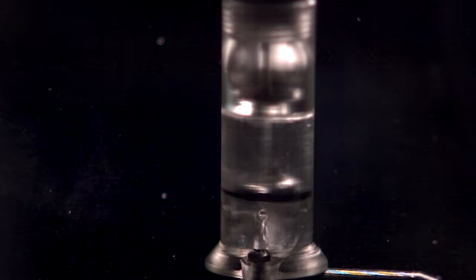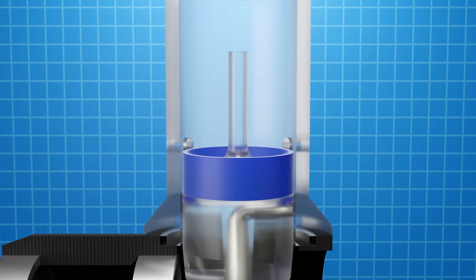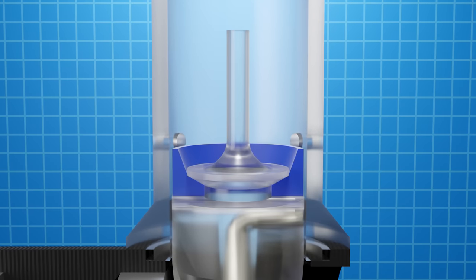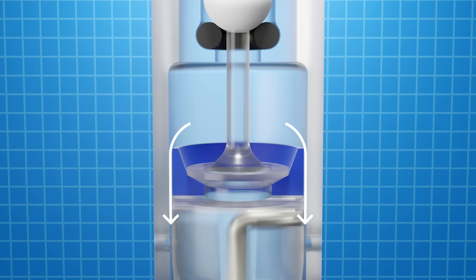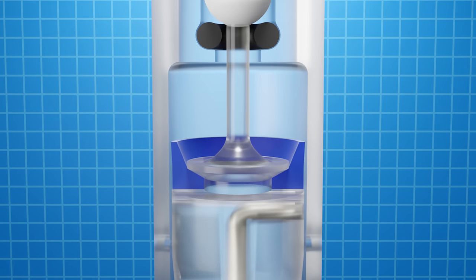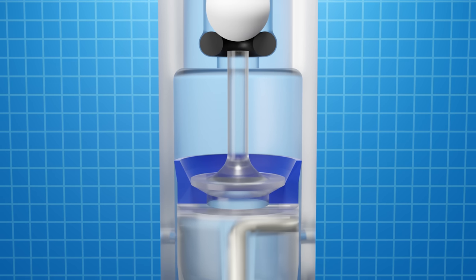So what's the solution to this? I'm going to make my own piston seal. This new piston seal has a flange on the top that expands and contracts depending on the pressure above it. So when it moves up towards the valve, it allows the air to flow around the piston. Then once the valve opens, the air pressure will cause it to expand and seal against the cylinder, hopefully better